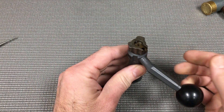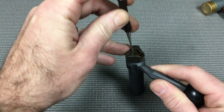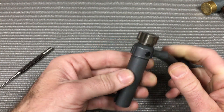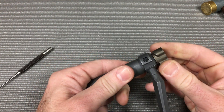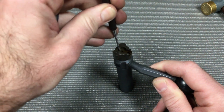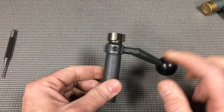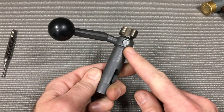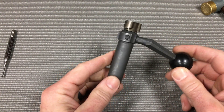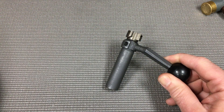Now this pin is fully seated, and your ejector spring is no longer in contact or under any pressure. That groove is now where the ejector spring sits, so your bolt head moves nice and free and your ejector spring has all the travel and energy it needs — nothing is being taken away from the spring. That's how the pin stays retained in our bolt head, and to remove it, you just get the ejector spring to move off to the side so the pin can squeeze by.